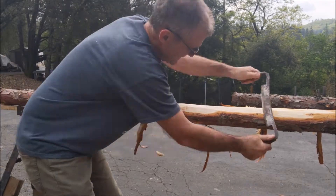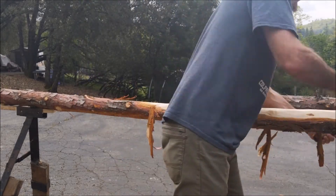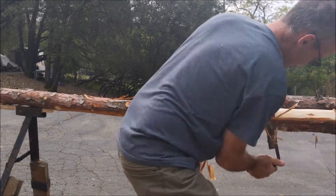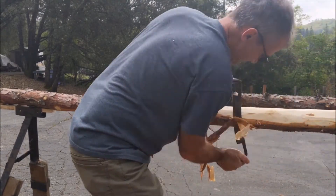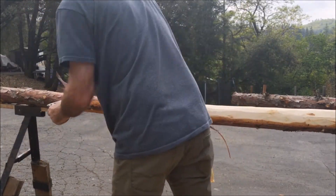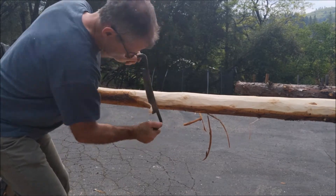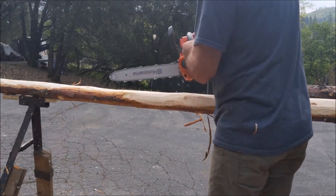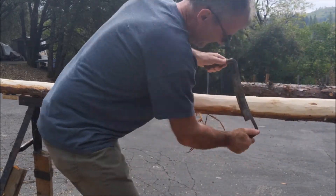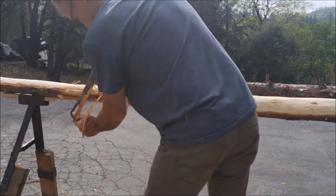This is at five-to-one speed and I'm just cleaning up the knots. I screwed a piece of plywood to the bottom at the ends, pinched it in my sawhorses, and one sawhorse is actually tied to the hitch of my truck so the whole thing isn't moving around. It's incense cedar so it's pretty soft wood — easy and enjoyable to work with, smells really nice. I'm trying to get a nice clean smooth outside, and then I'm going to slice it down the middle and clean out the inside. It's not supposed to be perfectly round — it is a natural element.